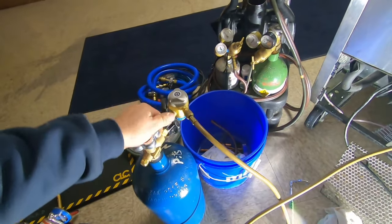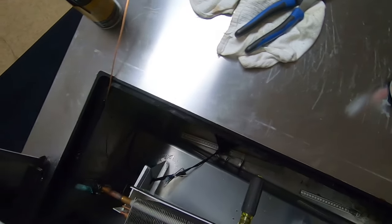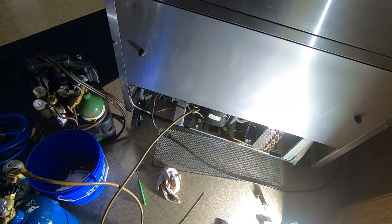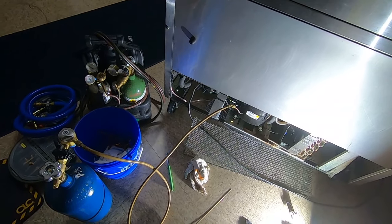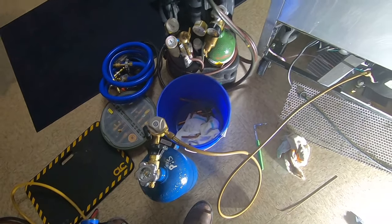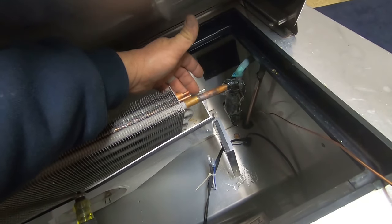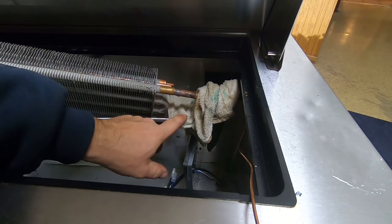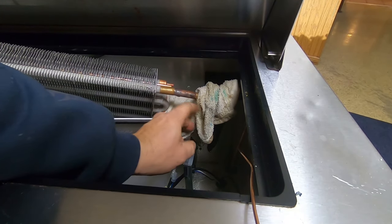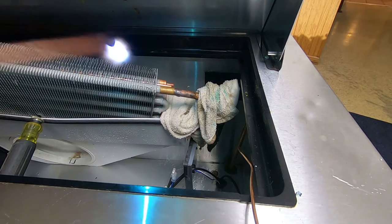I have my dedicated line here to a little purge. Get everything out of the coil and all that. Once that's done, go down to purge only, wet it, and then I can feel it—I know it's coming through. Get the rag on there. That's going to help protect the plastic over here and also help protect that insulation that's on the suction line.